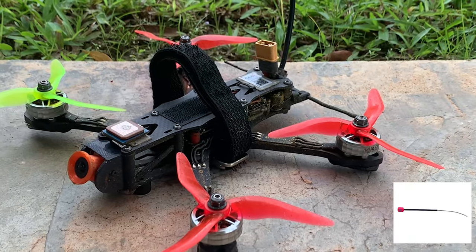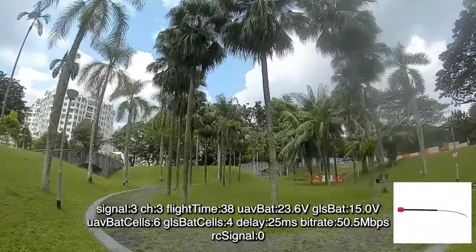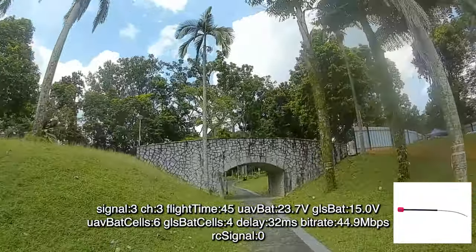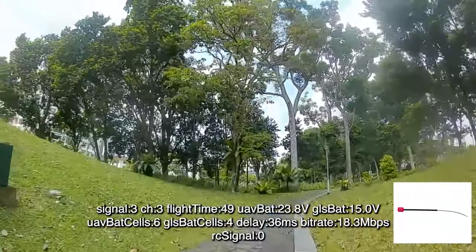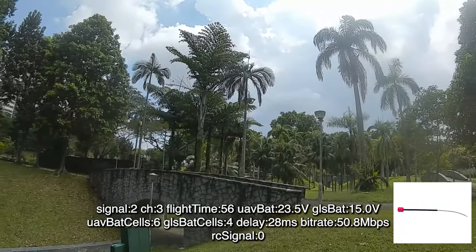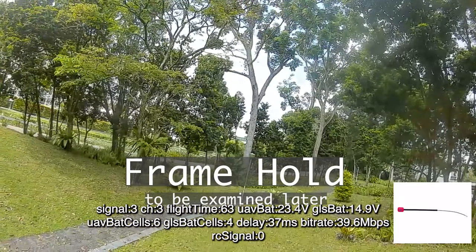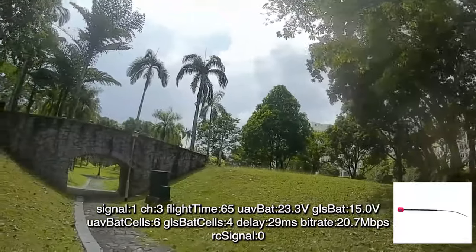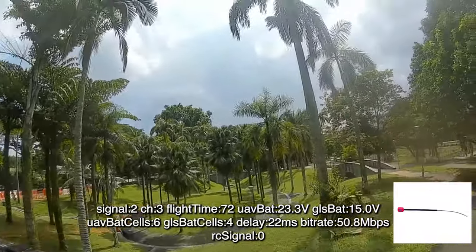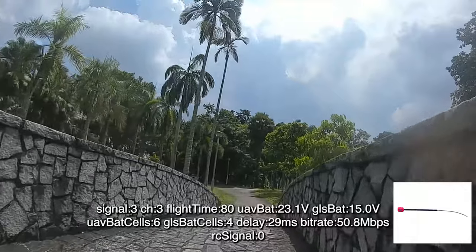You'll notice that the picture quality did not degrade as much as with the stock antenna. Changing to the long range antenna definitely increased the penetration power of the signals, and thus the image quality was better. The final run was done with the maple long range antenna — it costs about one third the price of the TBS, and it produced almost identical results. The image quality was actually a little bit better, which gave me confidence to go a bit slower and lower to see if the delay would make flying uncomfortable, but it was okay.